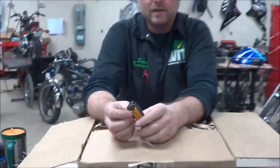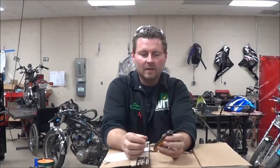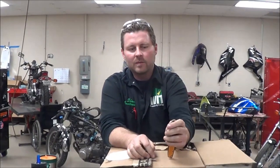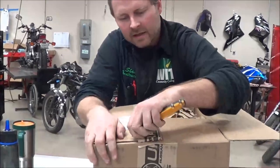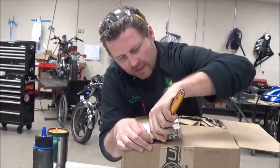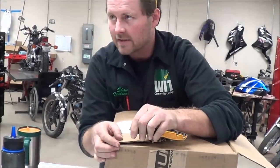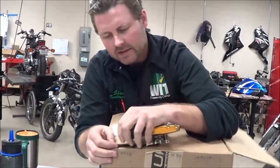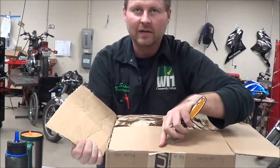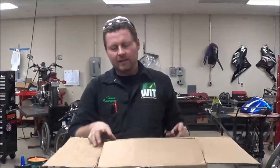So let's do a quick summary. Your little checklist: number one, open up the invoice and find out what's inside that box. Number two, be extremely cautious. If you're going to use a knife, get your finger all the way up on it so that all you're doing is scoring the surface — not going through the thickness of both sides of the cardboard. If you've never thought about this, take your knife and measure the thickness of a piece of flap. Figure out how much knife you need to go through there. I should be able to do this without even cutting the bottom flap — and notice I didn't cut it. That's my tip of the day for technicians that end up in the parts department. Think about it. Be diligent. Quit ruining parts when you open them.